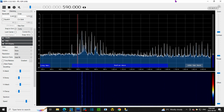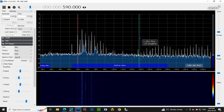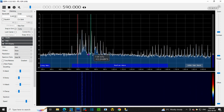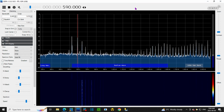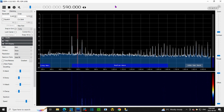Now we're going to listen to this. Before I put the sound on here from the SDR, we also have a switchable capacitor that will jump the range of the antenna, because the antenna's tuning range is smaller than the AM band. So I have an auxiliary capacitor. I'm going to click it in. And so what's happened is the resonant point has gone lower yet. So now I'm going to tune the antenna the other way.